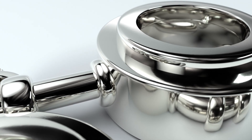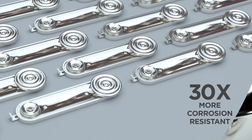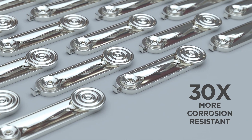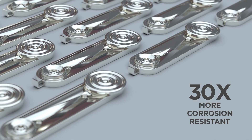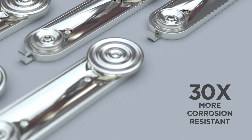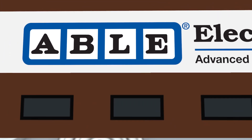The resulting surface is ultra clean and bright. In fact, it's this bright surface that has helped give the electropolishing process its name. Electropolishing results are consistent, repeatable, and leave parts with an improved finish that's clean and free of contaminants from machining and prior finishing processes. Electropolishing is also 30 times more corrosion resistant than using passivation alone, and parts are passivated in the process.